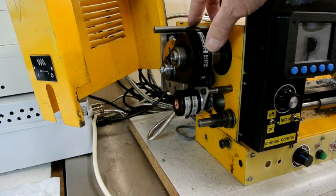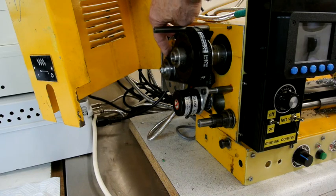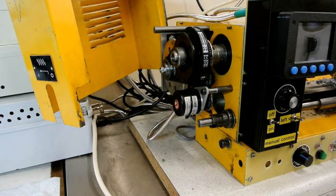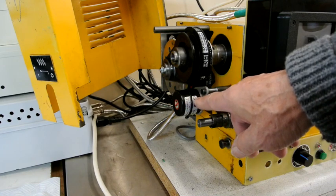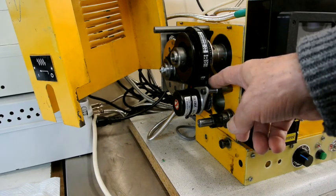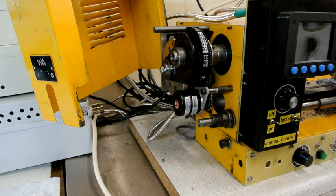This is the main spindle here, and the belt that runs the motor to drive the spindle goes to this motor at the back, which is the same 24-volt 500-watt motor I showed you up on the top. They're really quite reasonably powerful and you can feel quite a bit of torque especially at low speed. This is the encoder — a standard industry encoder — and it operates via a tooth belt which runs down there. That sends a signal to synchronise the speed of the spindle with the amount of stepper motor drive going down the lathe.